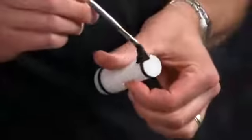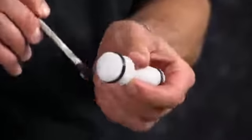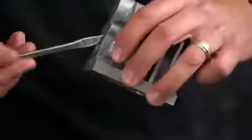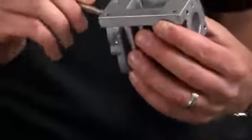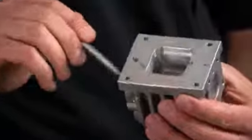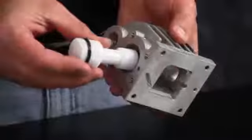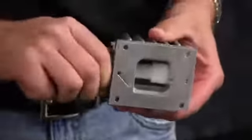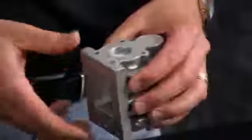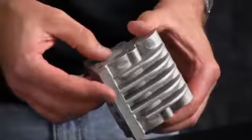Be sure to apply grease. Grease is applied to keep the items from catching, binding, or cutting while assembling components. Also be sure to apply grease to the main air valve body. When installing the air valve spool, be sure to compress the U-cup seals so they're not damaged when installing. Be sure that the main air valve spool moves freely within the air valve body.